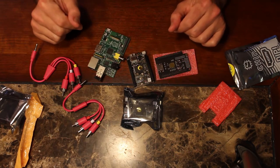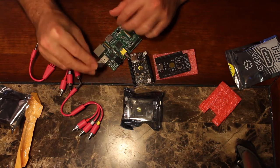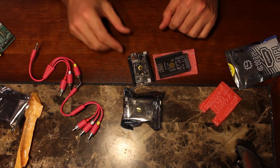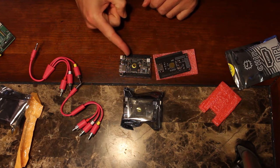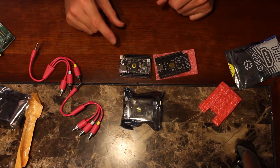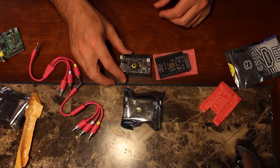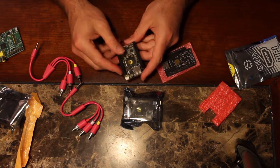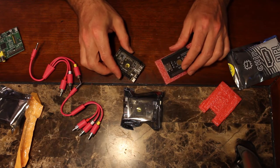You can use the USB port for more storage, and since the CHIP has Wi-Fi built in you don't need a USB Wi-Fi adapter, freeing up that port. So again, not as powerful spec-wise as the Raspberry Pi, but at $9 plus $5 shipping — and shipping is somewhat combined if you order more than one — it's definitely cheaper. It's a full Linux computer with GPIO pins. They even have a portable companion accessory — a keyboard, screen, and battery pack that turns it into a portable tablet, for around $60–70.